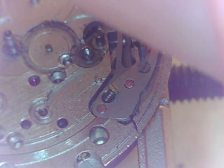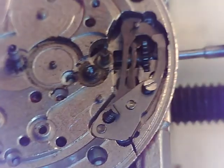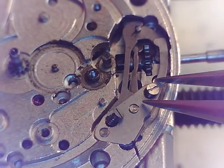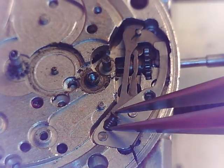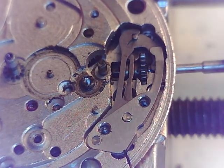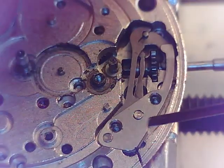From here, I wanted to say that the other side of this watch was running real good. The balance and the main train appeared to be running very good. So I think our only problem was this — the hand setting gears, all that mechanism.